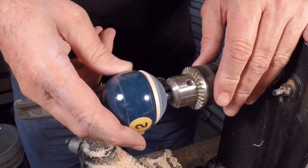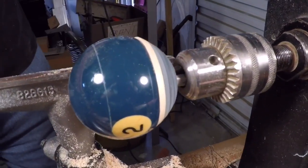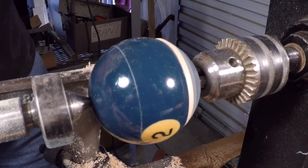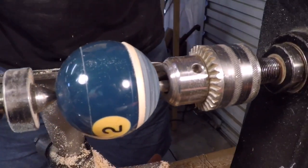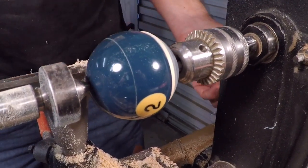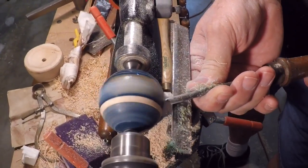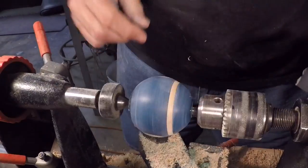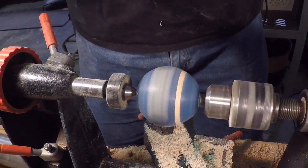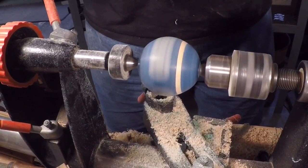We've been back and forth getting this thing fitted up and I've got a nice registered fit now. I can push my live center up into the base and smooth this thing out to recover the nice spherical shape. It's off just a little bit. I'm getting the top and the bottom to work together using a conventional tool and sandpaper, getting this thing pretty concentric around the center axis so it'll sit real nice and concentric when it goes on the base.